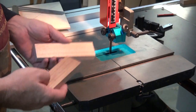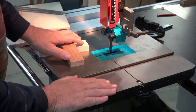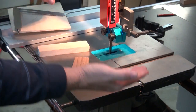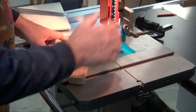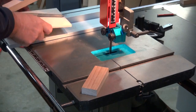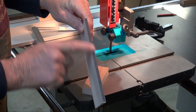This is the halved lap dovetail joint, or the half lap dovetail joint. It goes that way and we cut a dovetail here. You need a table that will drop both outwards and inwards to do this one. I'm using the Laguna BX14 and it drops this way and that way. You have to know what angle it drops to on the inboard side — this one drops at eight degrees. So I've set it all up so the dovetail joint will be an eight-degree angle on the tail itself. To make it easier, I've got a template here cut with an eight-degree slant, with double-sided tape and 240-grit wet and dry to hold it in place.